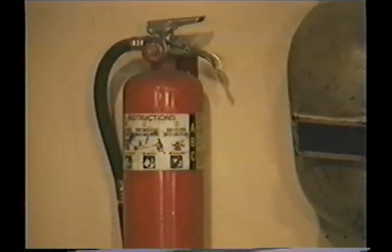Always keep a fire extinguisher for all classes of fire handy and know how to use it. Frayed clothing will catch on fire, and avoid clothing made of synthetic materials — synthetics melt to your skin if they're burned. Wear leather boots or some other protective footwear and always wear safety glasses. It is totally uncomfortable to take a hot piece of metal in the eye, and it's not a whole lot more fun when the eye doctor has to dig it out. There isn't any way for anybody to cover every safety situation. Safety is an attitude — when you make working safely the number one priority, you'll do fine.